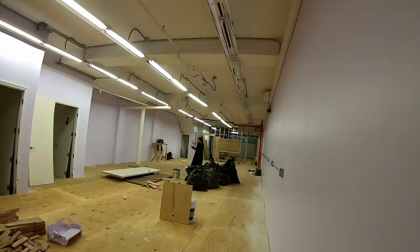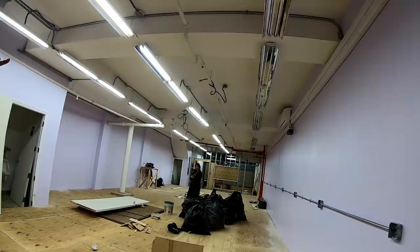And the next was to install a 2-gang box in the ceiling above the counter and run that along with the front lights, because we wanted to have those televisions that Jeff showed in the picture. So when we turn off the front lights, the televisions will turn off along with it.